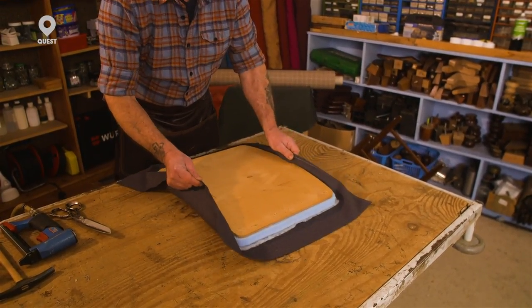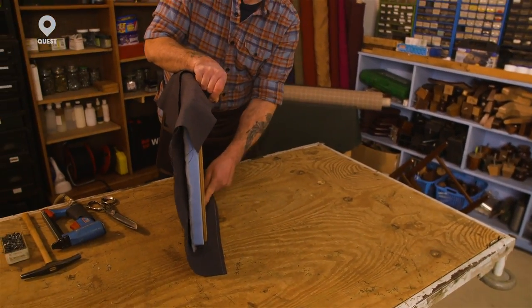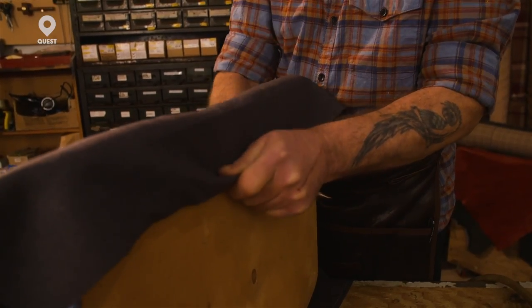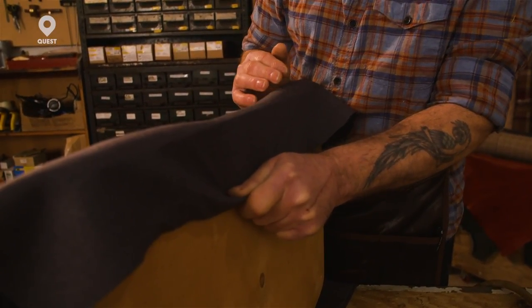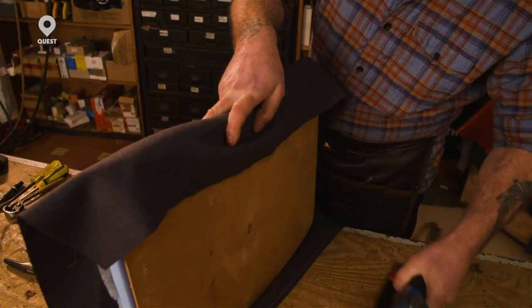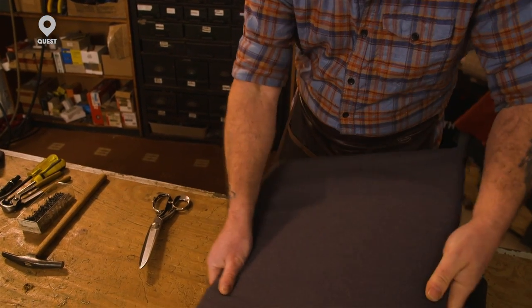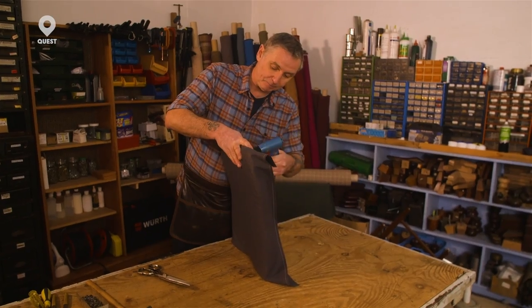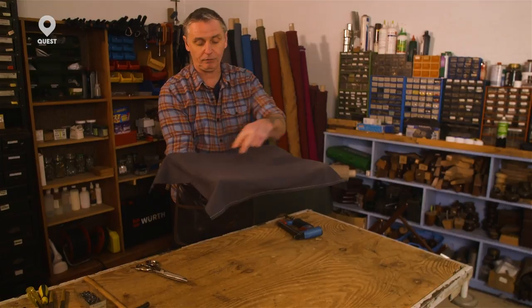So what I'm doing is picking that up and standing it on its edge, holding both the fabrics so the fabric can't go anywhere. Literally pulling it over with the whole of my hand, pulling from the end of my thumb to my wrist. If you pull with the whole of your hand you get a nice smooth finish. Stapled there — just a couple of staples in the middle. I've pulled that in the centre again, so now you've got it pulled on all four sides.